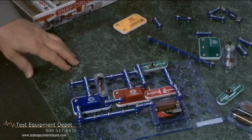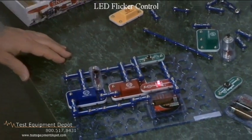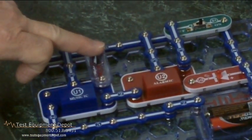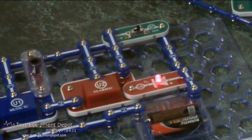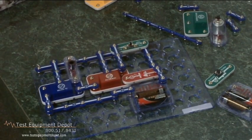One of the many circuits you can build with this is a light-controlled flash circuit — this is a flashing LED. You just block the light from the photocell, and the LED goes off. When the light comes back and hits the photocell electric eye, the light comes back on again.